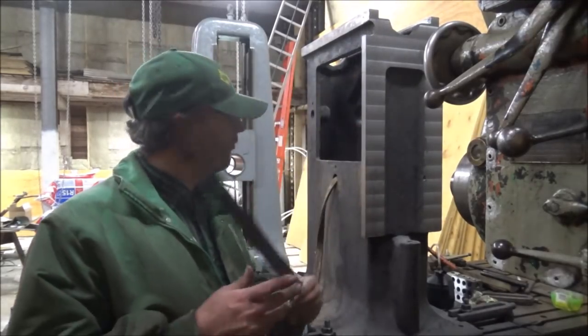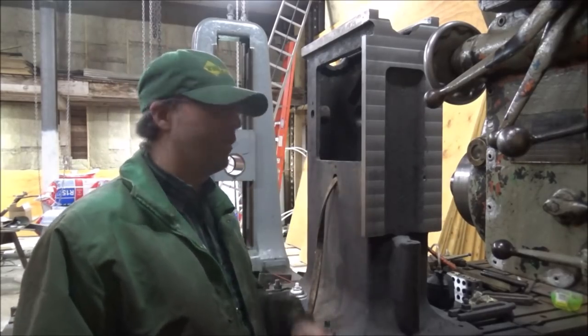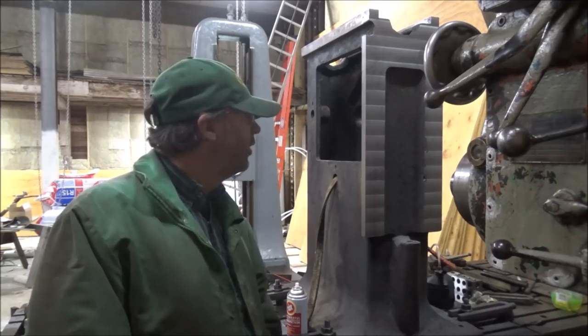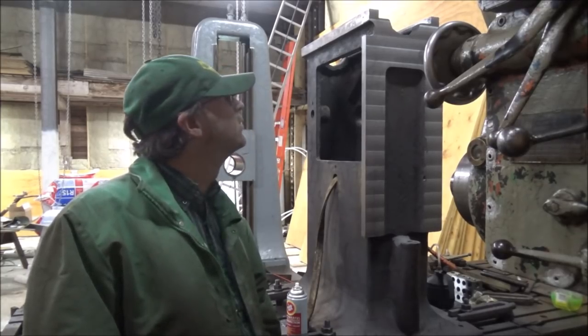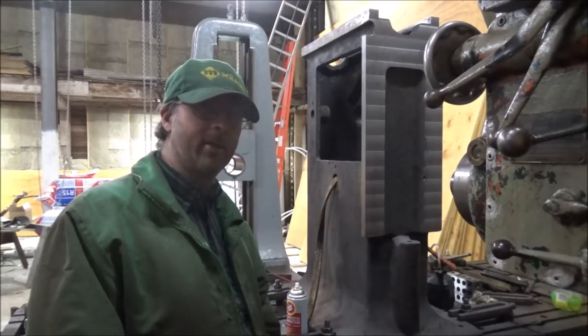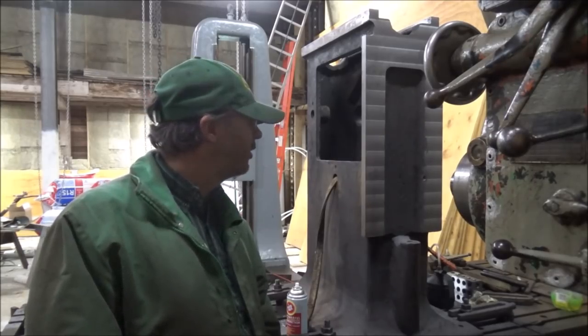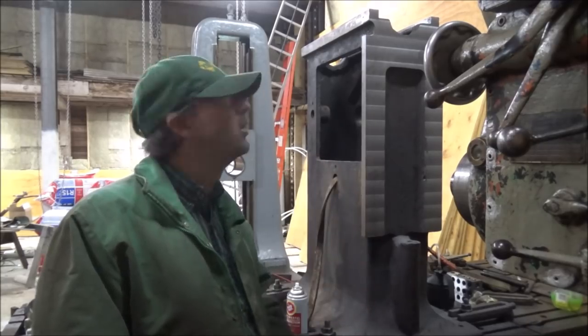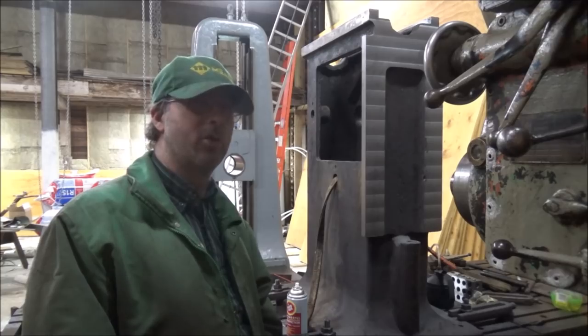And about 12 inches, 12, 13 wide, roughly a 2 foot by foot area. So to mill a 2 foot by foot area and have it within a thou that's not fly cut is probably decent. With a fly cutter, I could probably get this better. Maybe. Single point's usually a little more accurate.